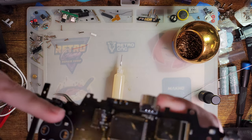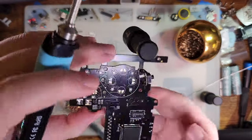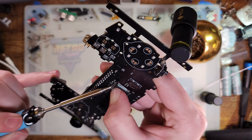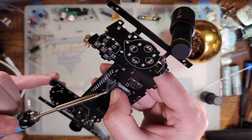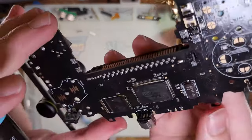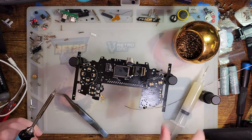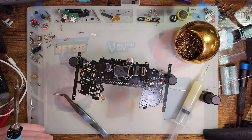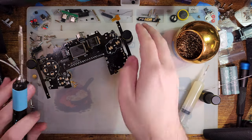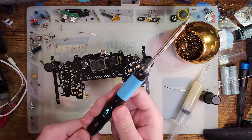Quite a few of the pins on the bottom side don't look like they're actually soldered down. Some of them look to be straight missing their pads. It's kind of hard to see, but that's the result of me dropping the CPU right as I started filming. This would have gone so smooth had I not done that. Alright, I'm gonna pause real quick and get this inspected under the microscope, and if there's any problems, well, I'll unpause and we'll discuss.